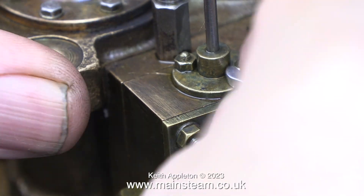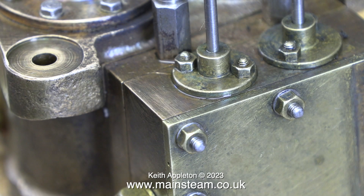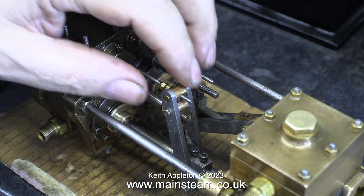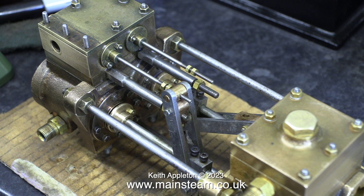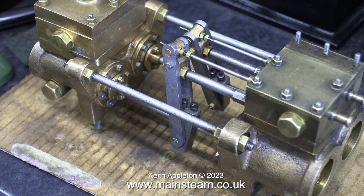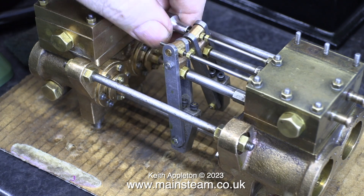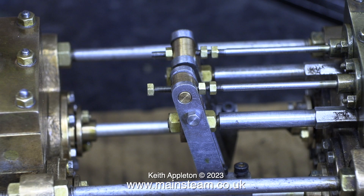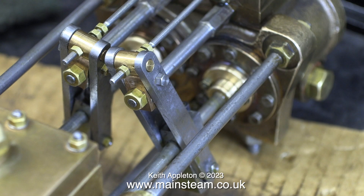After the nuts are 100% engaged with the thread it's a simple job, even though it's a bit long-winded, to use a small spanner to tighten them up. You cannot get a socket in as the nuts are too close to the centre boss. The depth of the hole in the valve glands is not as bad as on the piston glands but it's still too deep for the O-ring size. I was wondering if some very thin silicone rubber tubing would do — the stuff you'd use on a model aircraft engine — but no, I need to pull myself together. I'm just replacing these like for like. I will only send it back to the customer once I am happy with it, after much tweaking and a steam test that I will show as a video.